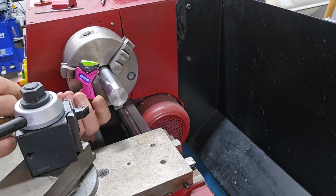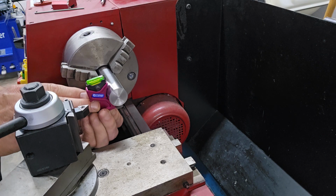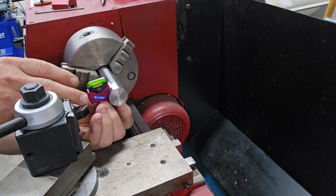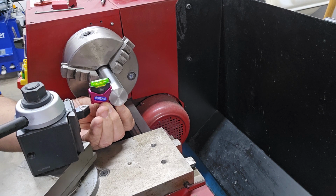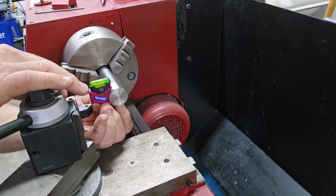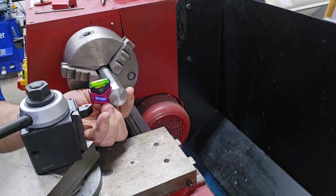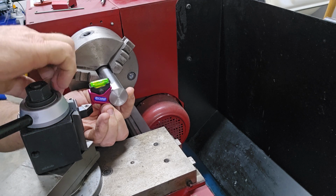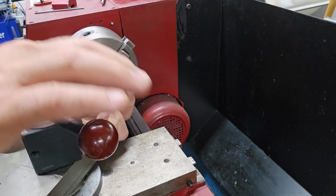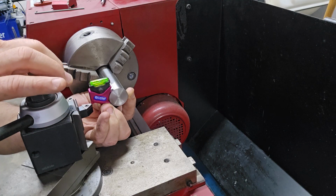And that's that one. The Speedy lathe gauge is only going to work if you have a piece of bar stock already in there, and there's a V along the back of it, and you push that up against your bar stock. You have to hold it very carefully to make sure it doesn't get tilted or uneven. It has to stay flat right up against the bar stock. Then I'm going to bring my cutter in, and hold on to the gauge so that it stays flat against the bar stock, and it pushes down against the cutter, and there it is. Now I have to hold that with one hand while I'm adjusting the tool height with the other hand. Once I get myself coordinated, it's really not too bad. So that's about it. Then just tighten things up and we're good to go.